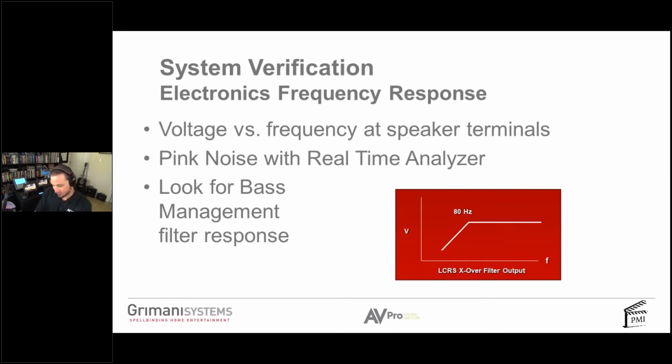One thing that could go wrong is that somewhere in the menu of the surround decoder, they had a mode called dialogue enhance, and you didn't see it. And suddenly there's a bump in the mid frequencies over here. There's a thing here that's pushing up 2 or 3 kilohertz. Or you may have had a high frequency equalization something or other, and there's a droop. Or actually, the olden days of bass and treble controls on the front panel of surround decoders is gone. Some of them still have bass and treble controls, but they're down inside a menu. You have to go find them.